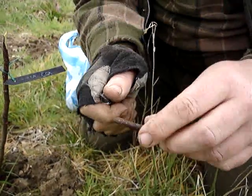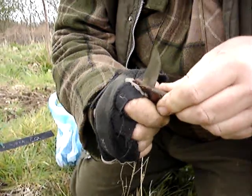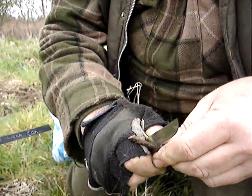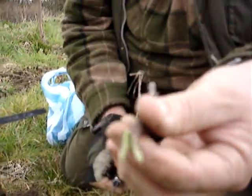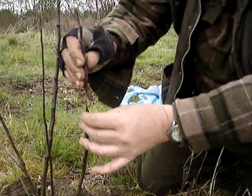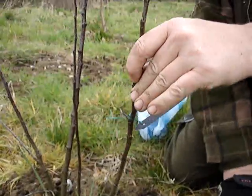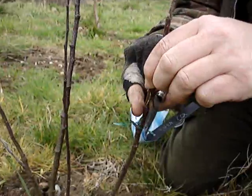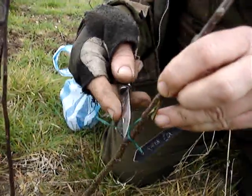I'm going that far, turn it round, similar cut the other side — you get used to this after you've done a few of them. You see what I've got there — that should fit nicely onto here, and it does. I'm just going to shave a little bit more wood off to get a perfect fit. What you want is live wood to live wood.